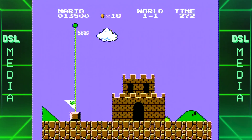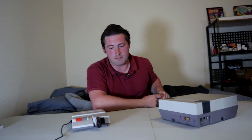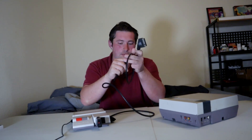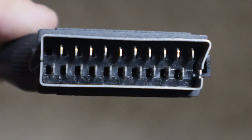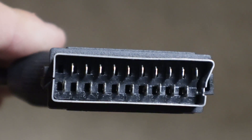While the RF modulator might have been good for its time, the video quality does not really hold up very well. Composite video cables did exist, and while they were good for their time, all of the video signals are compressed onto one video jack, which leads to some rather messy colors and the picture suffers as a result. Composite was the standard in the United States. Internationally, consoles like the Super Nintendo and the Genesis had native RGB video using this cable — this, ladies and gentlemen, is SCART. Unlike composite video, SCART has all the different color signals separated, which allows for a full RGB video signal.